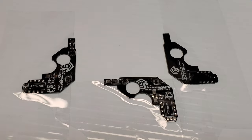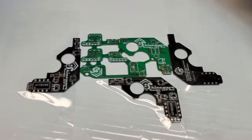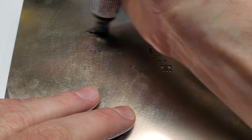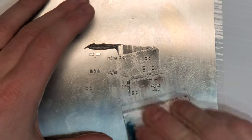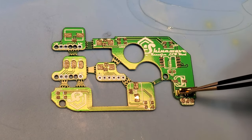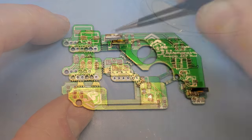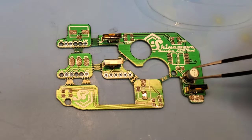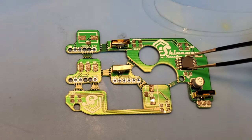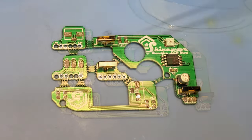One thing I thought would be cool to show is how you actually populate one of these boards. You technically can hand solder all these pieces in, but it's going to be quite difficult. So I've made a little rig here — not exactly my finest production, but for a beta board, this is how I do it. We're going to take this stencil and apply some solder paste using this credit card. This lets us place all the components and then flow the solder to make them stick to the board. The beauty of fully SMD components is that when the boards are ultimately assembled, we can use a pick and place machine to place each component precisely, accurately, and quickly.